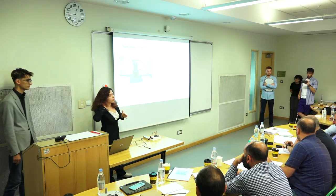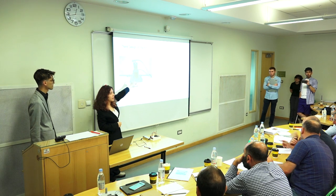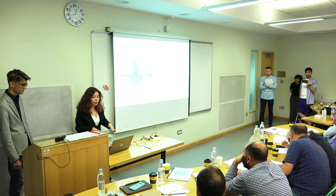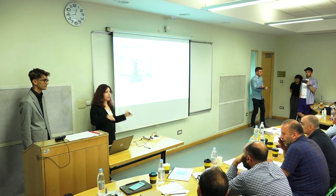So what we did, we removed the metallic pin and placed a plastic one instead, as it was still, because of the attraction of the bottom magnet and the nail, able to retain its position even without any power supply. So again, 0.22 millimeter copper wire was used, a total of 8 meters, and we were finally able to achieve reliable pin movement.